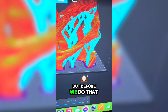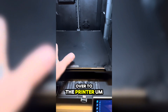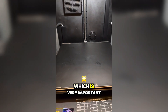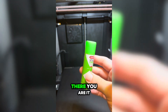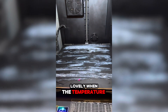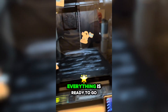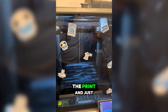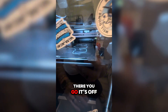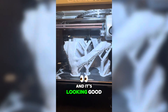We send it over to the printer by clicking the buttons here, but before we do that let's get the printer ready. Make sure the bed is lovely and clean. I'm also going to use some glue — it looks a bit excessive but it melts in nicely when the temperature rises and creates a nice sticky plate. Shut it all up, everything's ready to go, send over the print, and just like magic it's off. There's the first layer going and it's looking good.